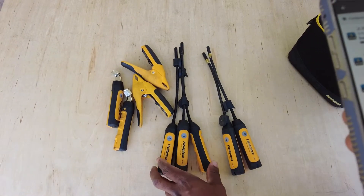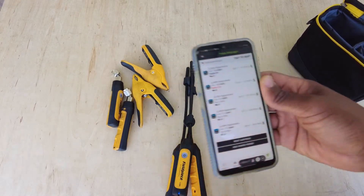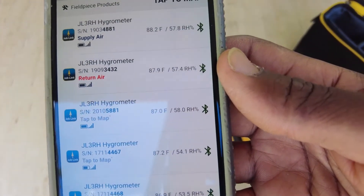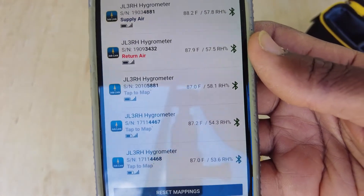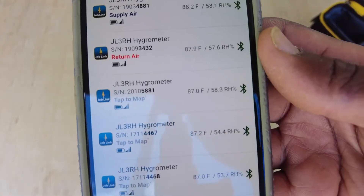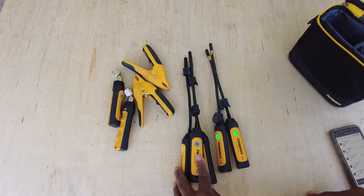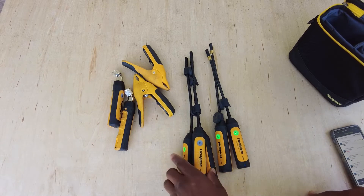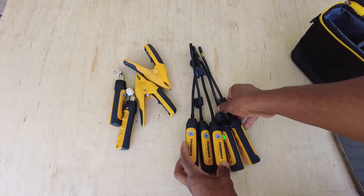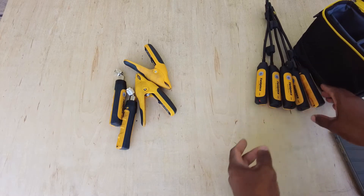The psychrometers seem to be in pretty good shape. I'd like to check how stable they are - a lot of times the temperatures will swing when the sensors are going bad, or getting old, or dirty. The temperatures definitely look pretty stable. I'll let them sit here for about 10 to 15 minutes. The psychrometers seem to be pretty solid and working pretty well. I'll set these up to the side and let them stabilize.